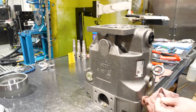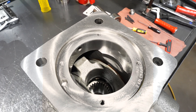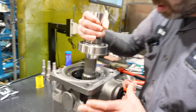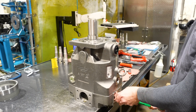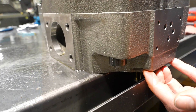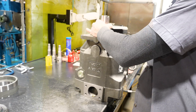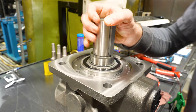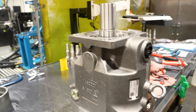This is a PV180. You're actually going to want to look inside - I'll just do it real quick - to show how it strokes. Now if you want to get the shaft in or out on this particular model, put it so it keys up. You can't get it in because it's jamming on the cradle. This is the port for the compensator that leads into the back of the servo piston - you're actually forcing it ahead against the bias spring so the cradle rocks out of the way so the shaft will fall in.